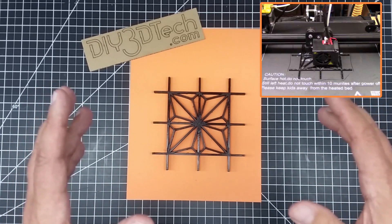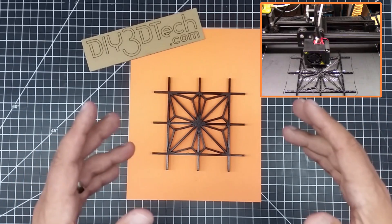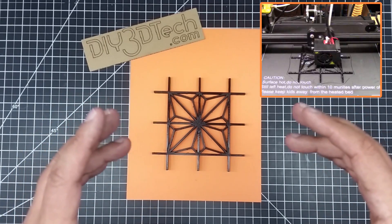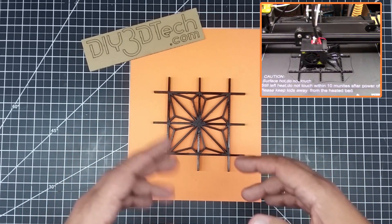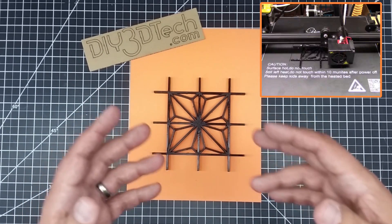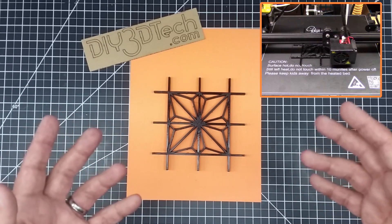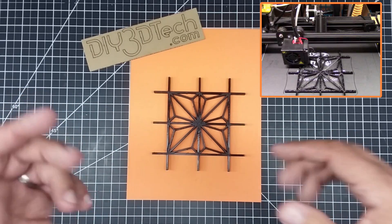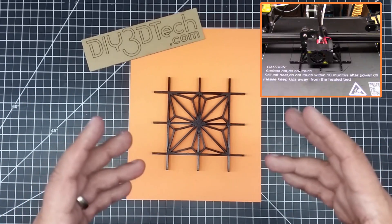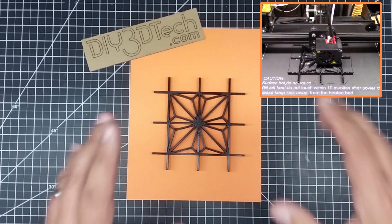I'll probably refine it a little bit over time. One of the things I want to do with this is turn it into other things — integrate it into a lamp, do it on CNC. But I figured I would start with the old 3D printer. I printed this out on the Creality. I took the Inkscape SVG, imported it into Tinkercad, and just extruded it. And here it is.